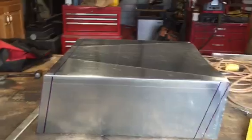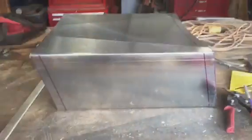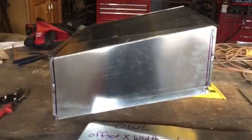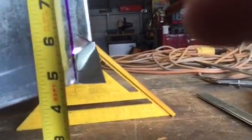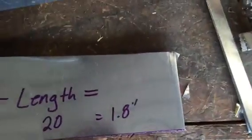When we raise this up, we have to take the equal amount off the other side. We got both sides cut, now we just have to notch for our S's and drive. This is how to do an offset on the job and this is how it turns out. Measure to make sure — four and a half. So offset times width divided by length gives you the offset you need to cut off your piece of duct. Thanks for watching.